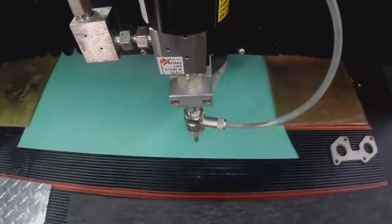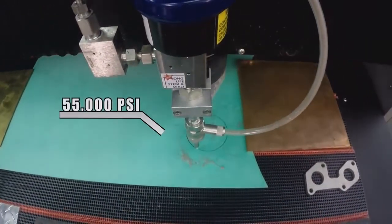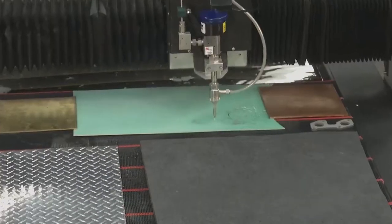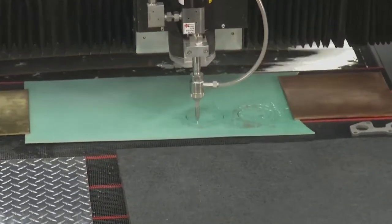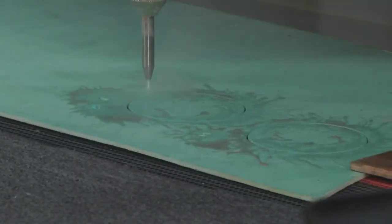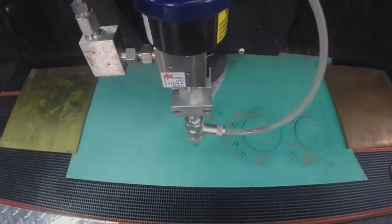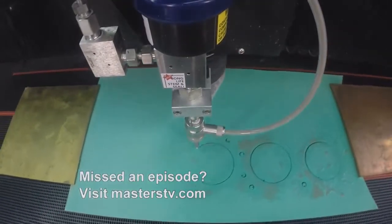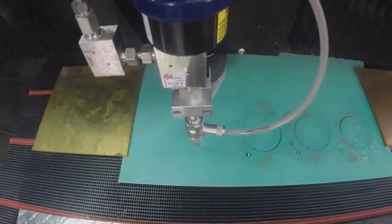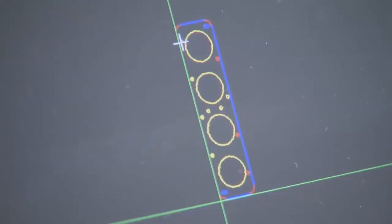So we start our pump up — builds the pressure. You see it go up to 55,000. It's actually cutting through that gasket material there, and you can see it's not traveling slow. That's motoring through the material very fast. At the end of this cut, you're going to see very clean cut quality, so it's going to come off as a finished product. When we talk about any sort of manufacturing business, this is your time and money and your material. The more cuts you get out of one piece, the less material you're going to waste. The quicker those cuts are made, the more productive your business is going to be.